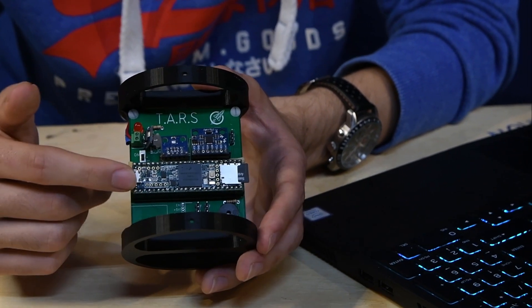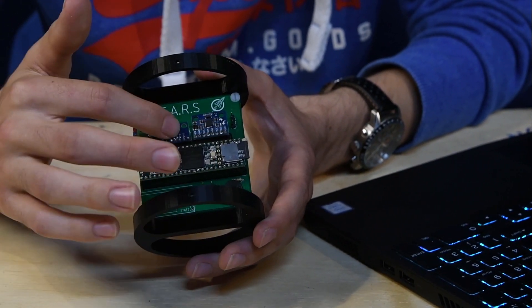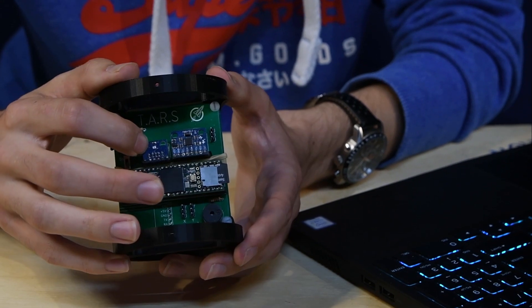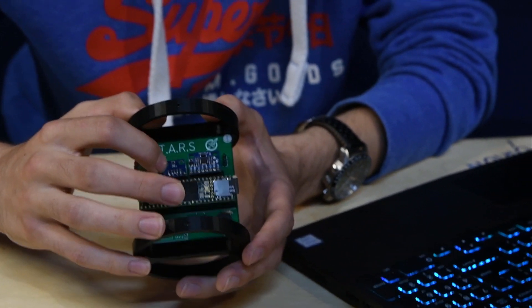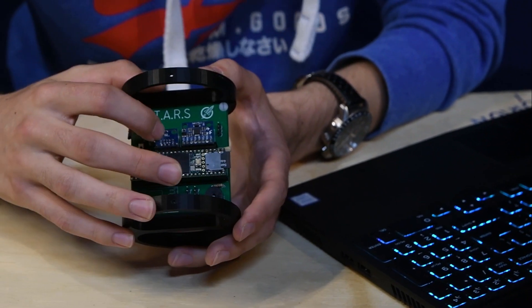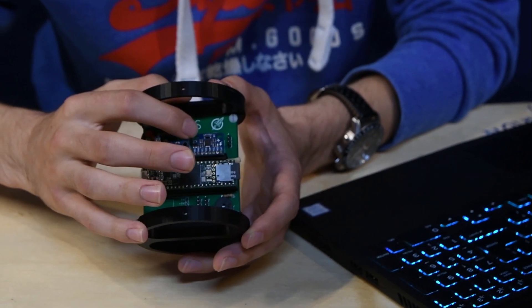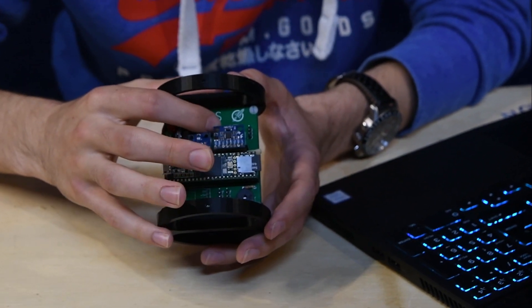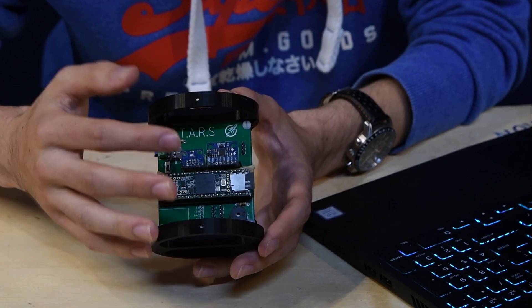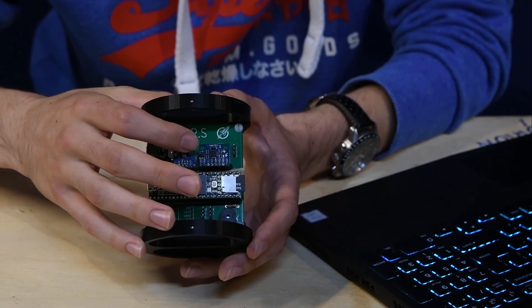The Teensy 3.5 is down here — it takes the input and is in charge of sending all the outputs to the servos and receiving all the inputs from our sensors. Speaking of sensors, we have a BMP280, which just reads pressure. You can use that roughly to calculate altitude, which is what we'll be doing to calculate our apogee — and maybe in the future when we do landings, we'll be using it for that. Then we have our MPU6050, pretty standard. It seems like most people use these for thrust vector control models because it's cheap, really accurate, and really reliable. If you know how to filter your data, you have nothing to worry about.